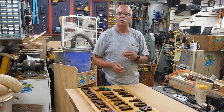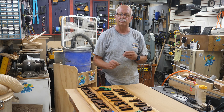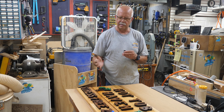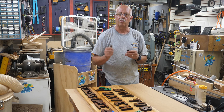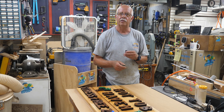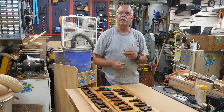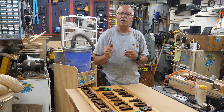The laser I was using was a Longer B1, 40 watt — I like to use that when cutting thicker material. This is half-inch nominal thick cedar, so actually about five-eighths since I didn't plane it. My cut-off pieces were too short to run through the planer, otherwise I would have taken them down to half inch and smoothed them out. But I did sand them after they were cut out. If you got anything out of this, a thumbs up always helps the channel. Roger in the shop — thanks for watching, see you in the next one.